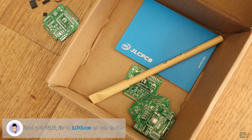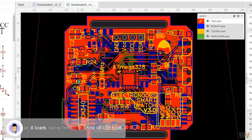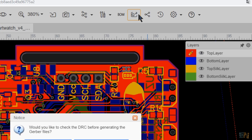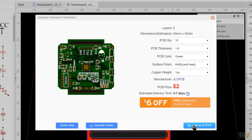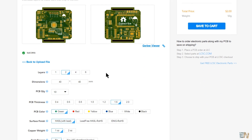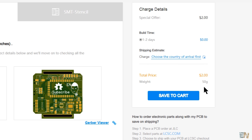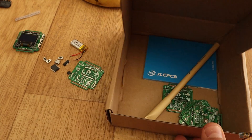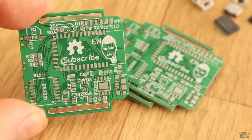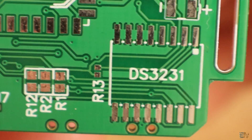This board was possible with the help from my sponsor, JLCPCB, which is a PCB manufacturer. Once I had the design made in EasyEDA and ran the design rule check, I downloaded the Gerber files and uploaded those to JLCPCB.com. Once the Gerber was uploaded, I selected 10 PCBs and the green color for the solder mask. That cost me only $2 and 6 more dollars for shipping to Spain. I received the boards in just 7 days. The order process was very easy and after a quick inspection, all the boards seemed to be perfect and with good finish.